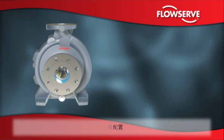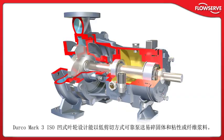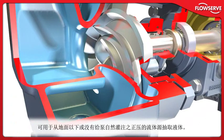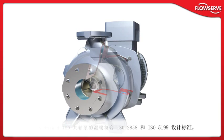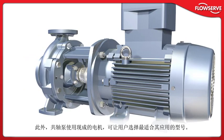Available configurations: In addition to the standard ISO design, the Durco Mark III ISO is available in numerous configurations for special process services. The recessed impeller design provides reliable, low-shear pumping of friable solids and stringy or fibrous slurries. Able to withstand run-dry conditions, the Durco Mark III ISO unitized self-primer is designed to draw liquid from sources below ground level or from sources with no positive pressure to naturally prime a pump. With a wet end conforming to ISO 2858 and ISO 5199, the close-coupled pump provides a compact, space-saving arrangement ideal for industrial processes where space is at a premium, using readily available electric motors.